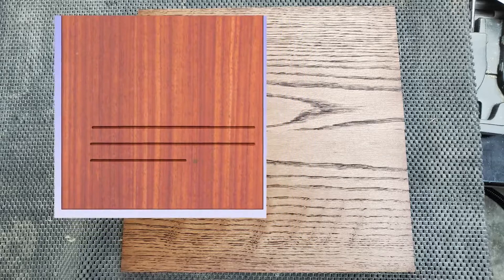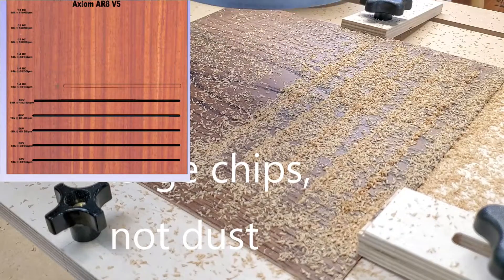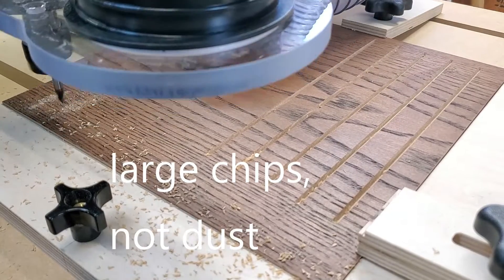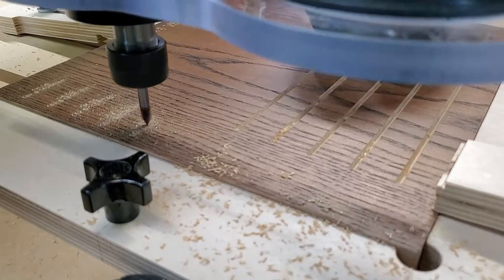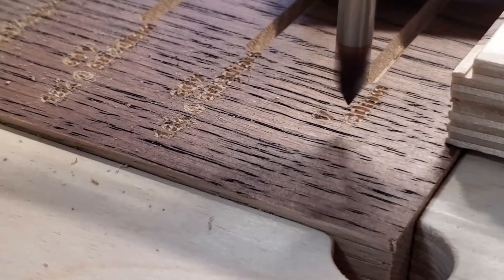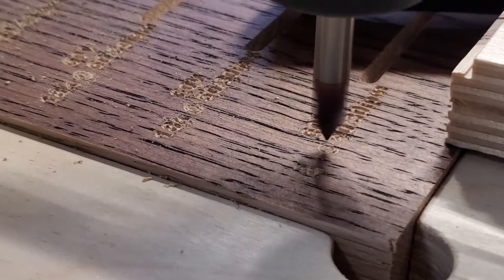I have my piece of red oak stained with General Finishes Java, same as the other test. I have the Amana 60-degree V-bit spectra-coated 45624-K. I ran my variety of toolpaths — I'm not going to go in-depth here; check out the other video for that. I just wanted to give you an idea of what I ran so you can see the test was performed the same way. You can see the V-bit does really well knocking out that real tiny text — I should have made it a little bigger, but it did a fantastic job.